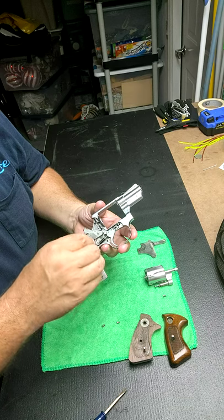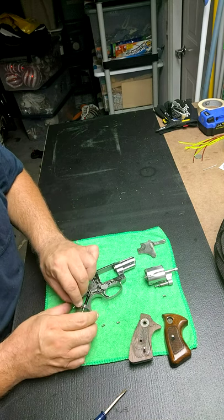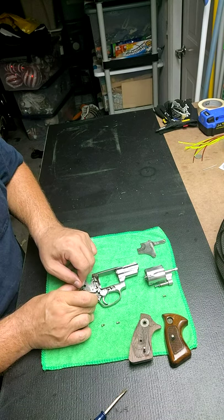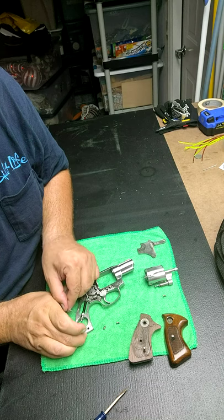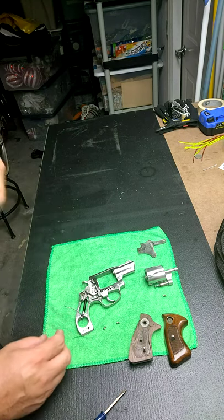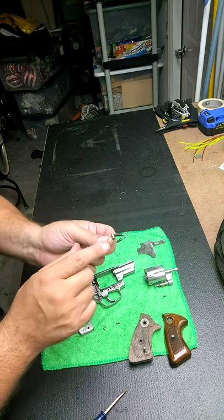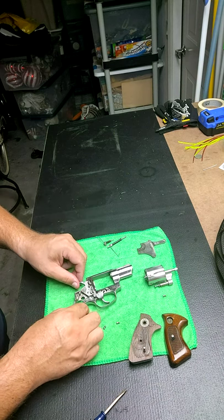There's a hole in that pin and also in your trigger spring pin. Pull this one up just a little bit — I'm going to apply pressure on the hammer, pull the trigger to release it, and let that go forward. That catches this one. Back here again — you have to kind of keep it up there; they don't give you that much room. And that's gone forward. As you can see there's a lot of play now because it's taken all the tension off. Set that aside. This one here you can pull out because there's a pin on the bottom that rides in that hole right there.